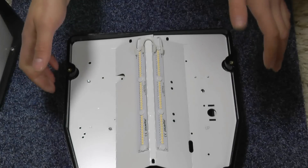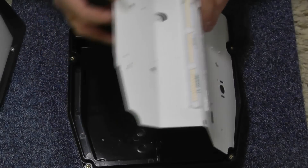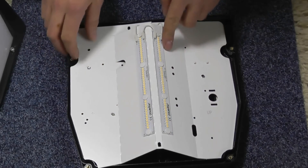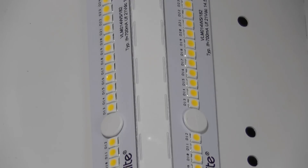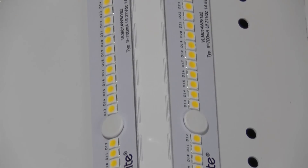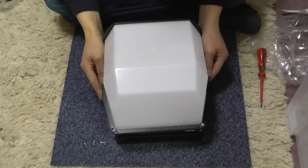What I'm going to do is try and find a plug, because I want to see this working before I go any further. It appears the metal substrate PCB has got these plastic clips which hold the chips in place, and on the underside it splays out — so it's just like push buttons holding it together. I'm obviously not taking it apart. I've no idea if it's got heat compound, but there's enough thermal mass to dissipate heat from a 30 watt LED fitting, and enough air space in the cover to keep it cool.